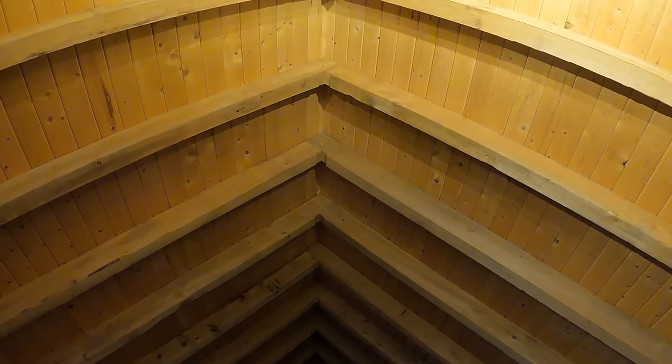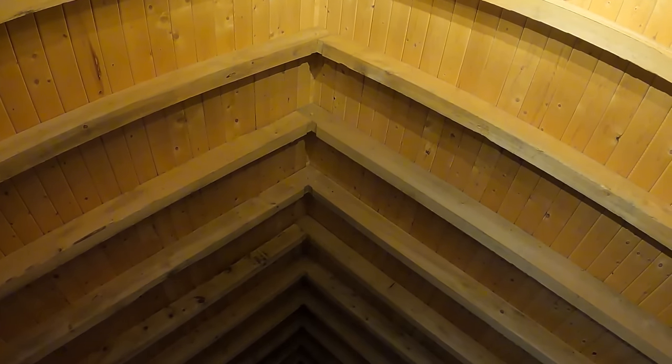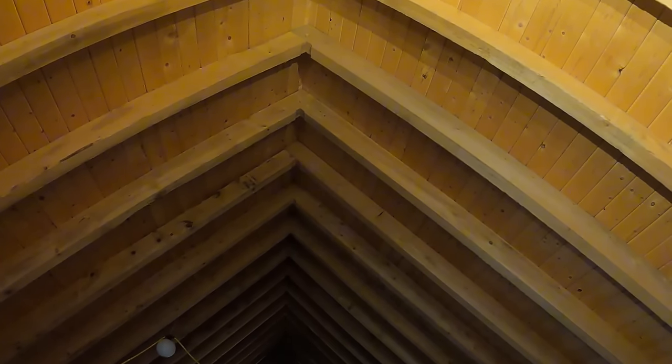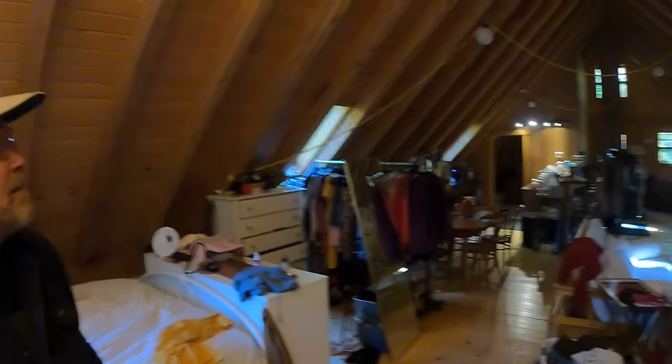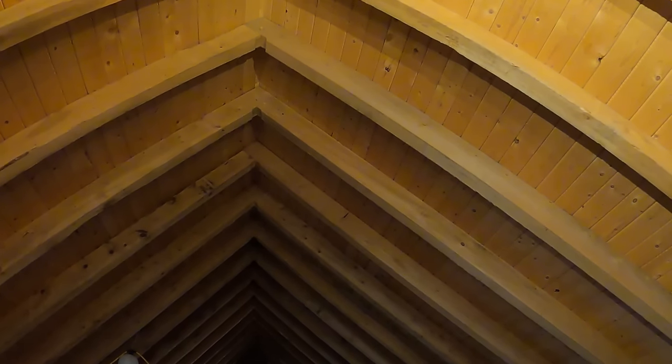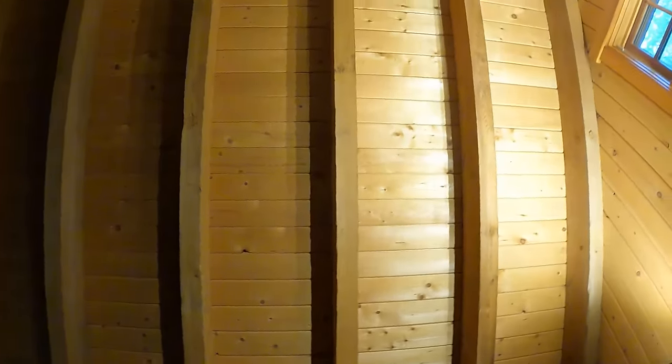So there's something I had never thought of or seen, and that is that rafters on a timber frame do not simply butt, but it's called tongue and fork? Correct. Okay, tell us about a tongue and fork. One is the fork, and the tongue goes into the fork. Okay, and then a trunnel, a dowel, a tree nail, goes right through both. Wow. Let me walk down here and see if you can see that. Probably see it best if you turn around.